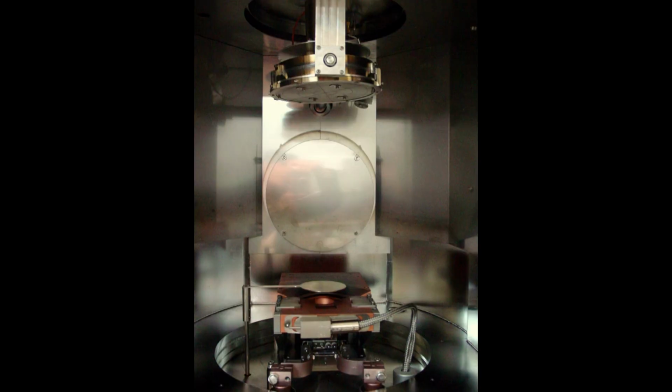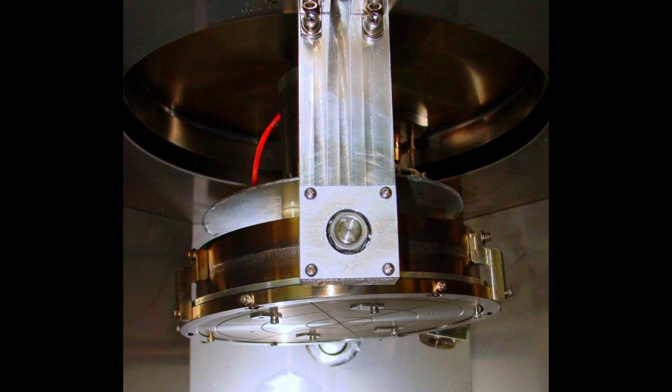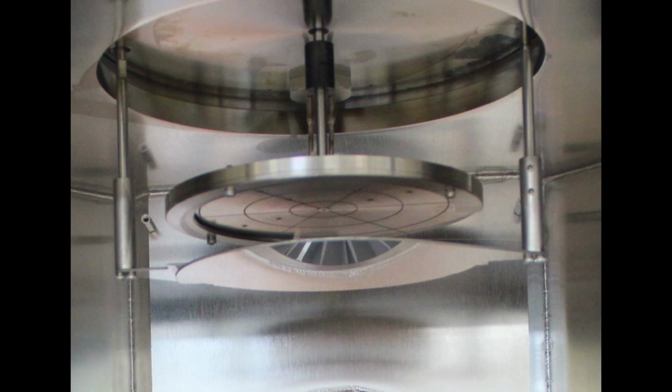Platen can be lowered and raised pneumatically and rotated at both levels. At lower position, wafer can be loaded or unloaded and plasma cleaned. At raised position, substrate is heated with resistive heated plate or IR lamps. Other versions with tilt during rotation are also available for GLAD process.